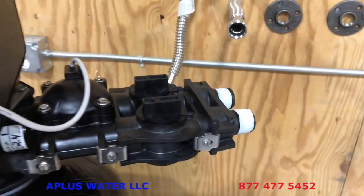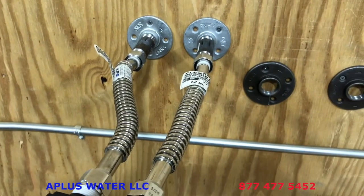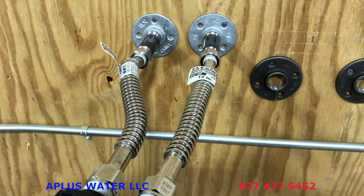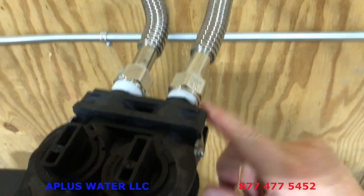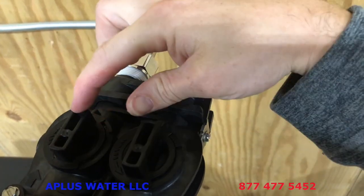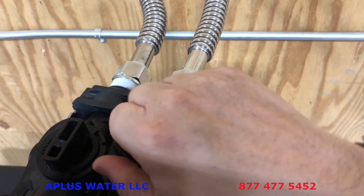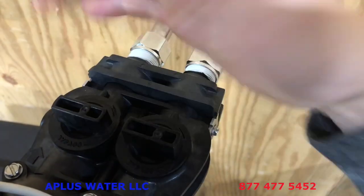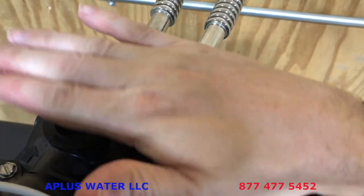Obviously you need to turn off the water to your house. However you cut into your pipes or connect — maybe you have a water softener loop — you're gonna have the water turned off while you do that and while you're connecting these. At the same time, make sure your unit is in bypass. If the bypass knobs look like railroad tracks — parallel with each other — it is in service. Turn them to bypass by twisting so they're in line with each other, stopping the water flow in and out. The unit is in bypass right now as we do the rest of the installation.